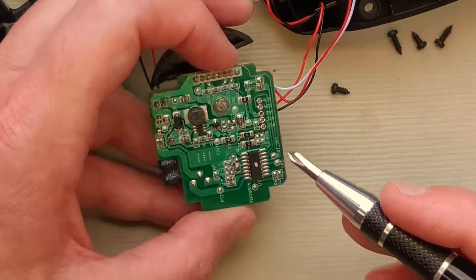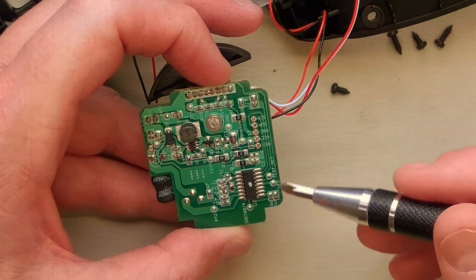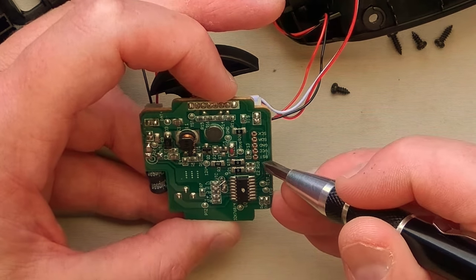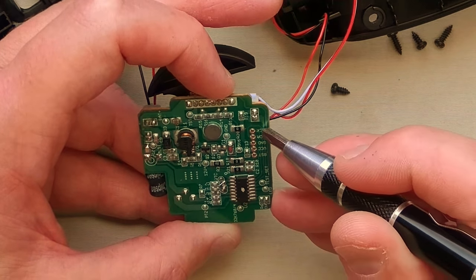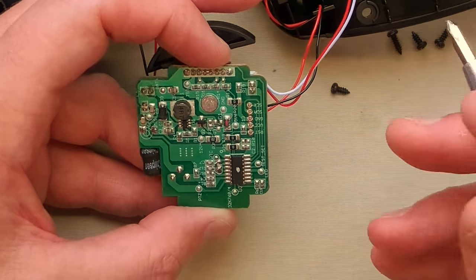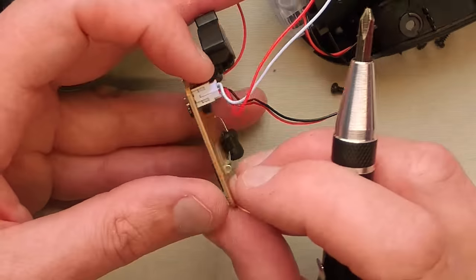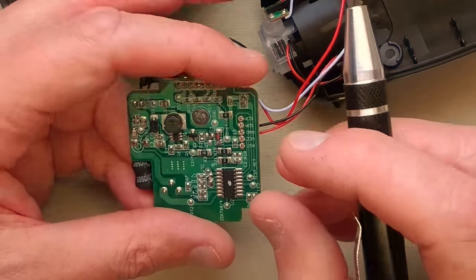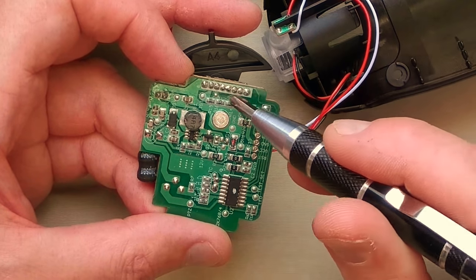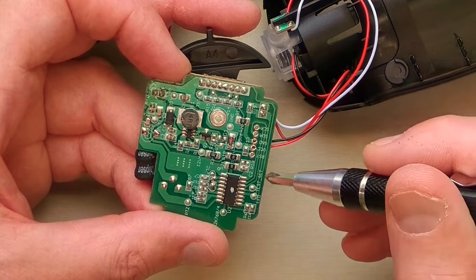One slight investigation later and here's what I've found. There is an anonymous chip — rather predictably anonymous — that controls everything. It's probably a universal microcontroller, because right next to it are five pins: reset, VCC, ground, data, and clock. So it's designed to be programmed in-circuit. I wonder if that's because they just change the software as the batch goes on, since the software is quite critical. This interesting little stud here is actually just a rivet that holds the switch selector mechanism on. The switch selector is a sliding switch with a bridge of resistors between the zero-volt rail and the positive rail, providing an analog voltage back depending on the switch position.